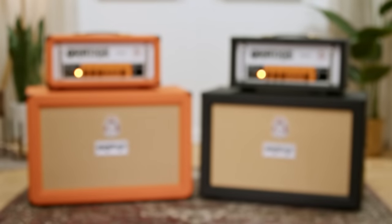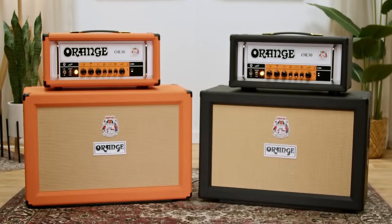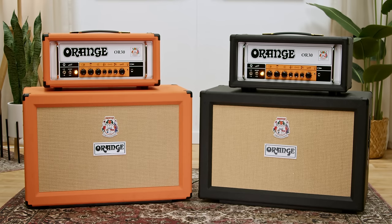The range of the gain control and headroom in the power section make this an extremely versatile single-channel amp. I'd say the real key to making it work is in the tone controls, specifically the high end: the three-position bright switch, very effective presence control, and the treble control in the tone stack gives three different access points to the top end frequencies. This wide range of control over the high end is critical to getting the right sound and response with every gain setting with any guitar or speaker cabinet.